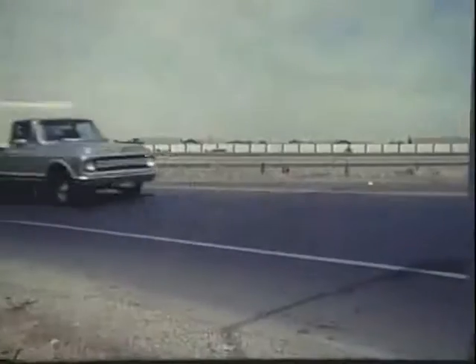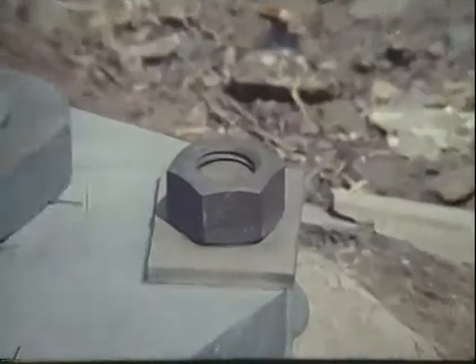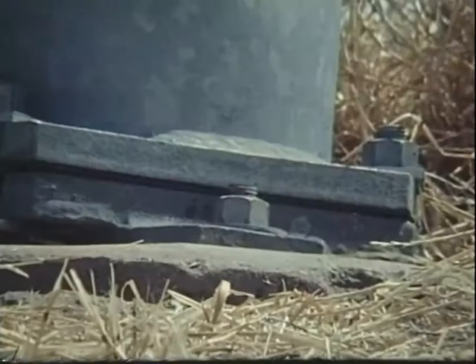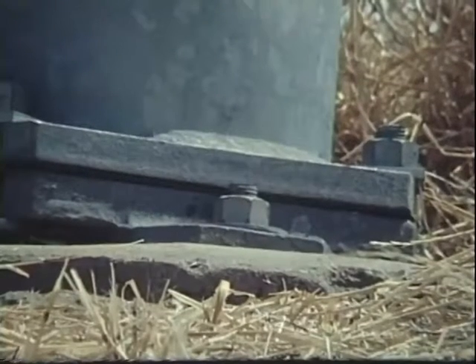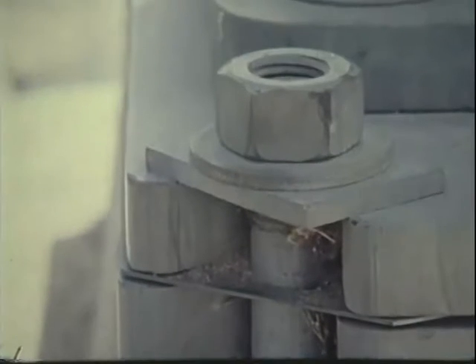Other incorrect assembly practices, which might cause serious problems, include the use of clamping bolts that are too short to accept a full nut. Long anchor bar stubs which extend too high above the concrete footing, thereby protruding into the slip plane. And the absence of hardened, round, flat washers, which must be sandwiched between the upper and lower slip base plates just below the keeper plate.